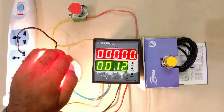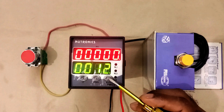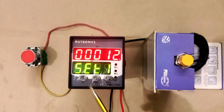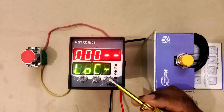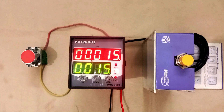Let's learn how to do programming of this meter. Press the mode button once — here 'Set 1' is shown, and the value displayed means how many times the sensor must sense before it operates the relay. Right now 12 is set here. If we want to change this value, use the up and down buttons. I changed it to 15. To save this, press the mode button. When an object comes 15 times in front of the sensor, the counter will generate the output command.